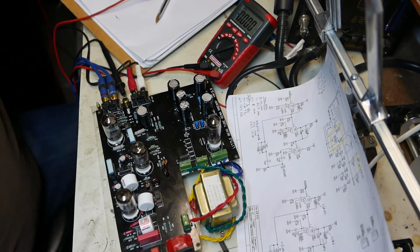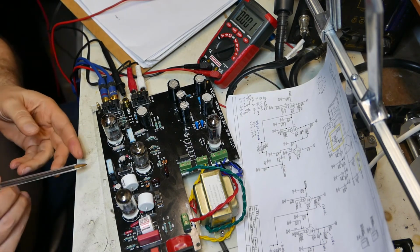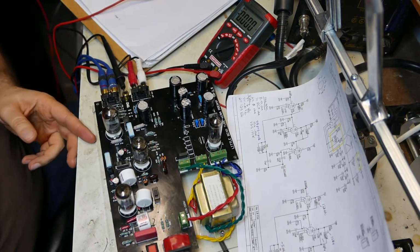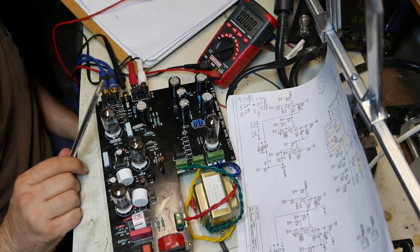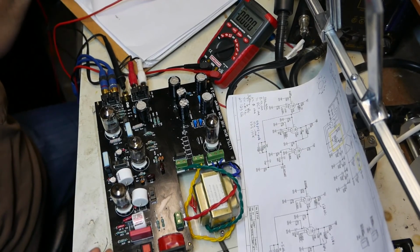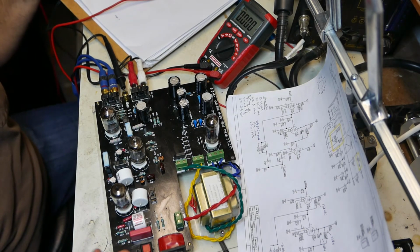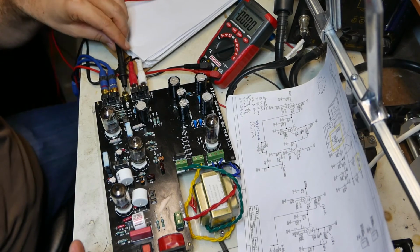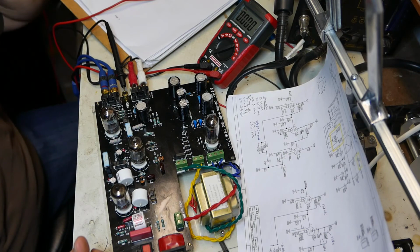Wow. Okay, those are all the measurements that I was asked to do. So I guess we'll go from here. Maybe I could, I don't know, rotate the tubes around and measure again. It's so weird how all the measurements are way different from a couple of days ago. Maybe when I did the audio injection test, I fried something. And I had the ground in the wrong place when I did it. It's quite possible. I read about that.